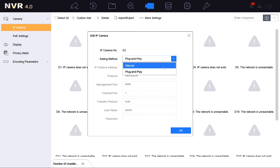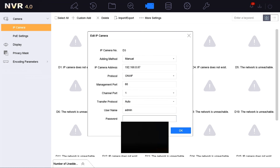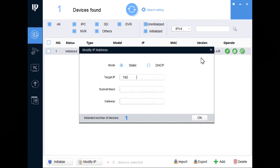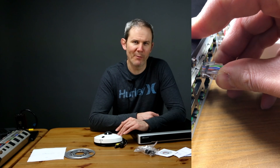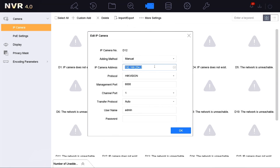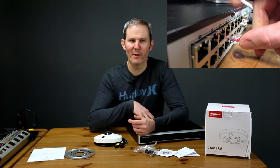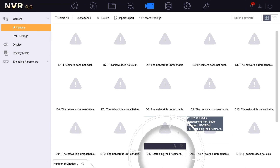If you're using a dedicated NVR to record footage, you can do so in a few ways. First, note the camera's IP address and port and enter the information into one of the channel placeholders on your NVR. The second way is by updating the camera's IP address to be on the same subnet as the NVR, such as 192.168.254.87, using the config tool, then plug the camera into one of the PoE ports on the back of the NVR and update the channel with that IP. If your camera is brand new and hasn't been activated yet, plugging it into the NVR's PoE port won't work — the NVR cannot access it, so you'll need to go through the activation process already discussed.